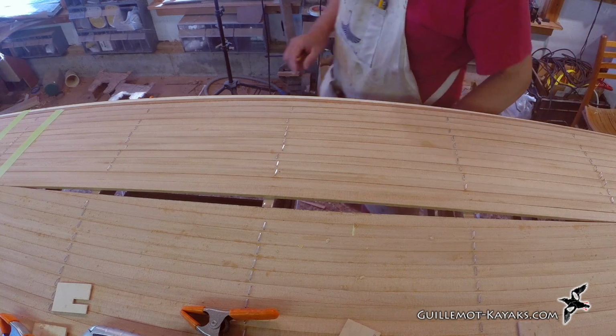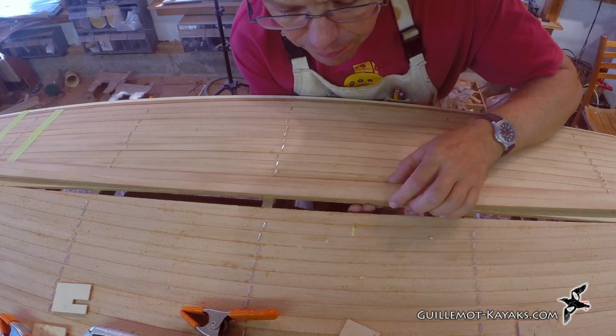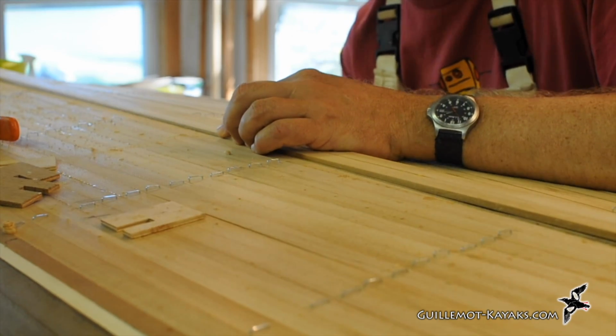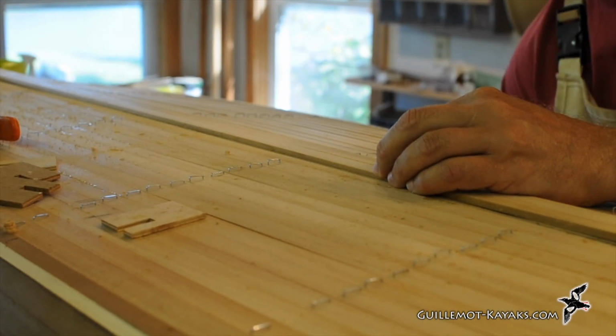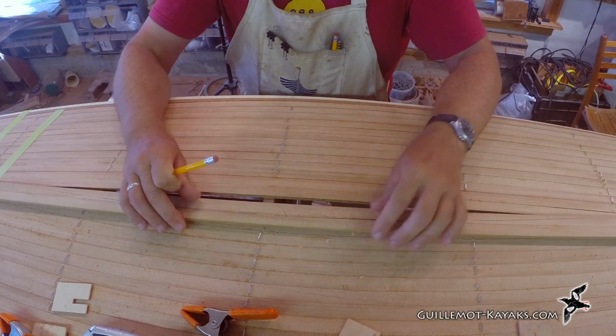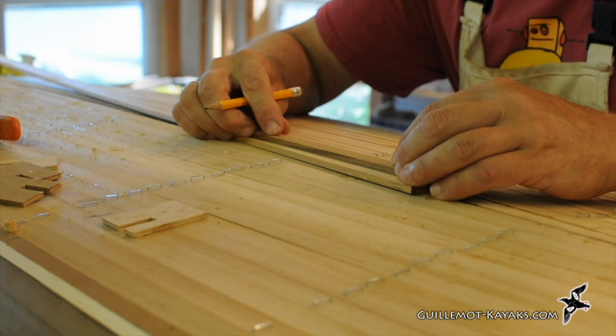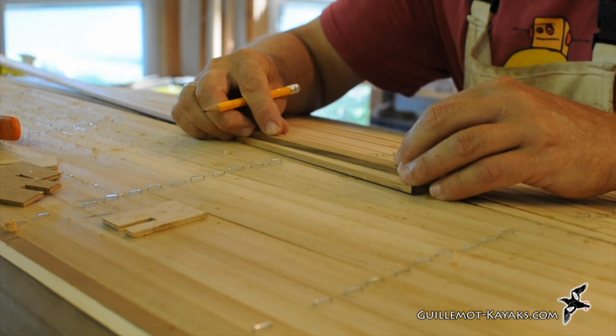When I get to the point where I have space for less than 2 strips, I glue a couple strips together. These will form my closing strip. I align one edge of this strip with the straight edge of the keel line, then reaching in from below, I mark the opposite curved edge with a pencil. The pencil didn't fit all the way into the pointed ends of the space, so I continue the lines using a straight edge.